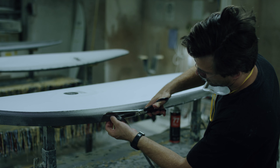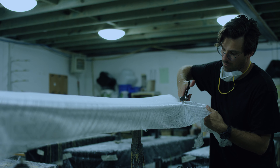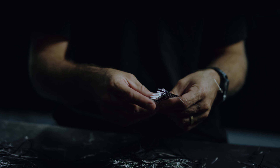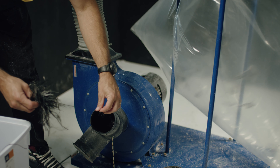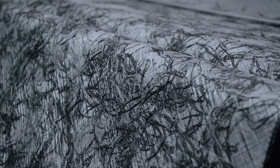One of the ideas was to utilise the offcuts of carbon fibre and glass fibre that we use in the lamination process and regenerate that into a new fabric. Right now we're testing the concept of aerating and fluffing up the carbon and glass fibres, so we'll be able to reintroduce that into the fabric weaving machines — utilising the waste and then being able to reuse that waste to recreate that cloth over and over again.